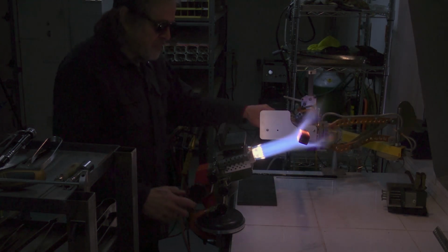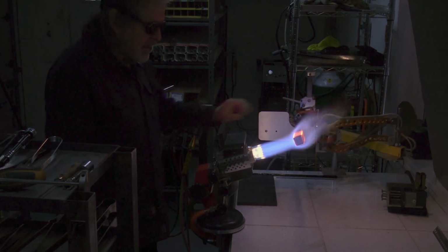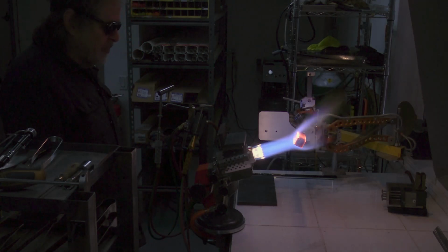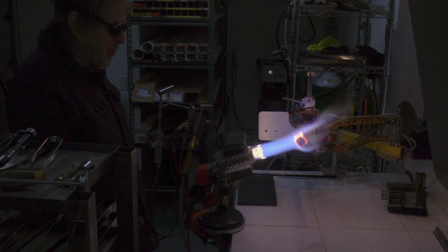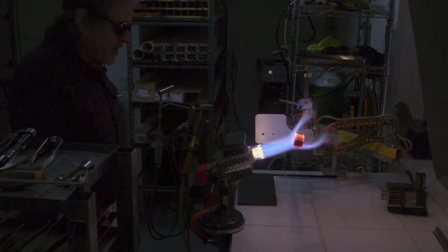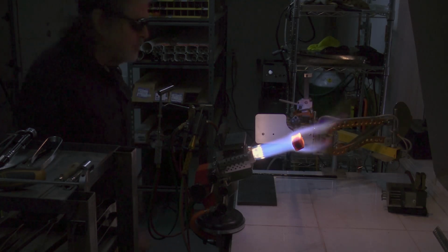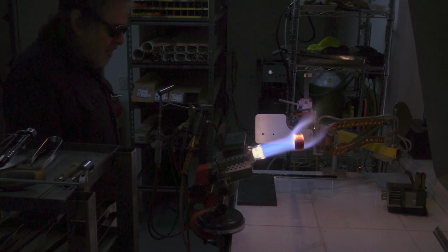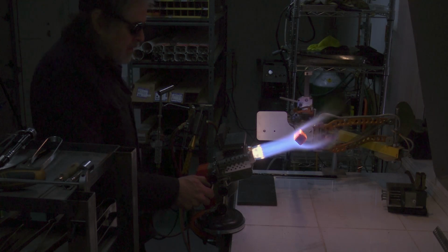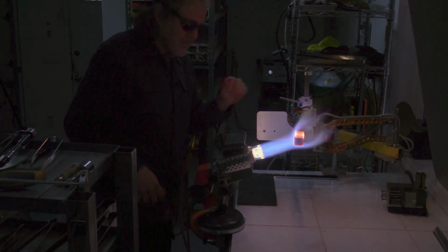Okay, 65mm Herbie running full on tanked oxygen from my 3 reserve tanks that I pump up overnight with the home fill, pump up to 1,000 psi in a bank of 3 reserve tanks, so that when my low pressure system can't handle it, and obviously this is way more than 15 liters per minute, when my low pressure system can't handle it, I've got the high pressure reserve.